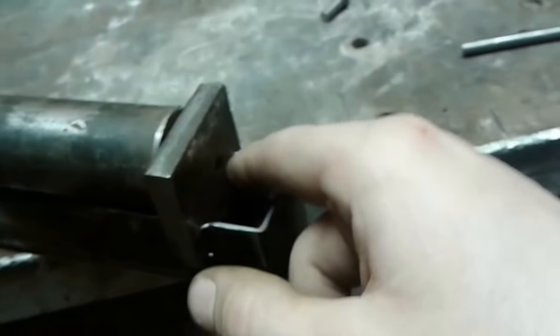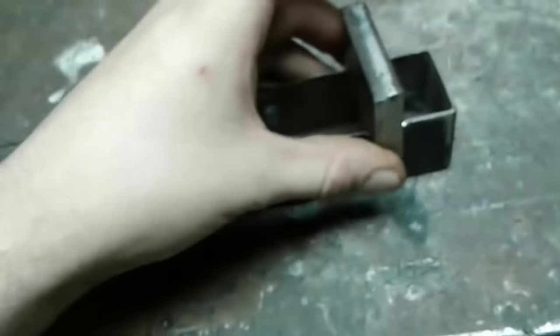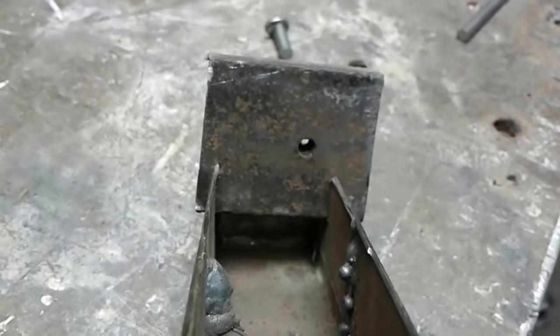It's kind of sketchy but I can do it with the tools I've got. Basically I would have to cut a large portion of the bottom out. New plan, new project, new gun, new struggles. The barrel overall has been left unchanged. I have this box tubing — I cut a big chunk out of it, took one of the ends off, and cut about four or five inches off. Then I cut a groove in here to fit, so it will accept it and I can prep it for welding. I also scored this entire thing.